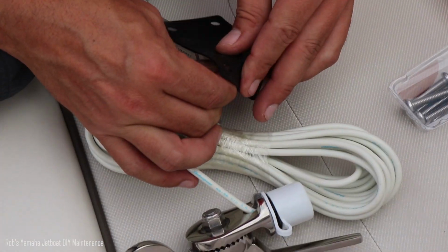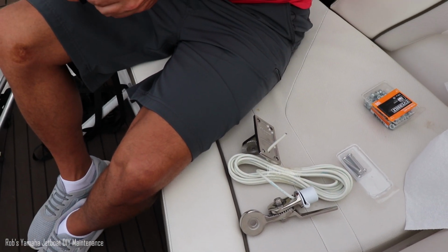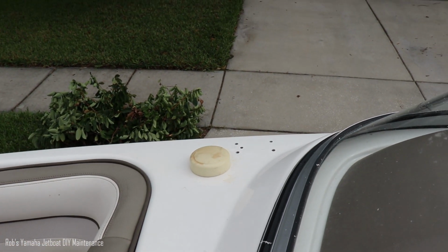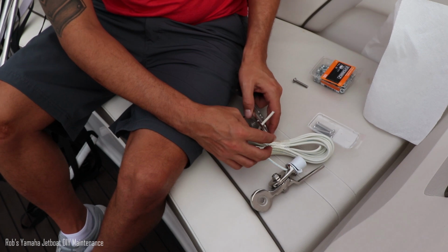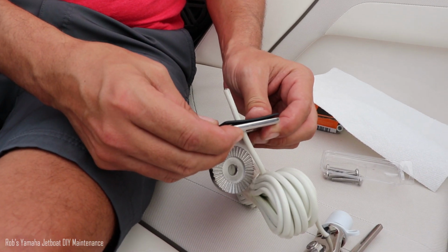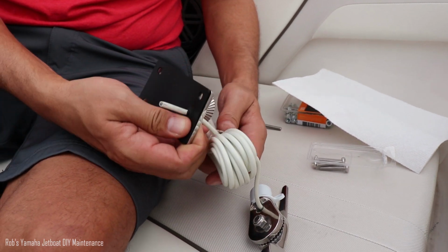Alright, so this antenna mount that Jeremy got comes with a little rubber piece there. You can see he's fighting it, running the antenna line through there. But it comes with a rubber piece as a protective measure. We're actually going to put some 100% silicone in there too to seal it all up around it once we tighten it all up. We actually drilled that hole in that mount so that we could make it all look nice and sleek. If you ever get something like this, it doesn't come with anywhere to route that antenna line, so we just did that ourselves.